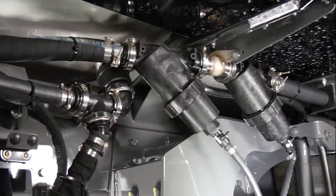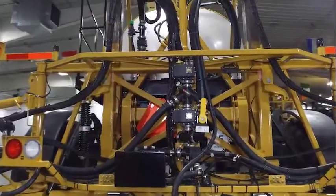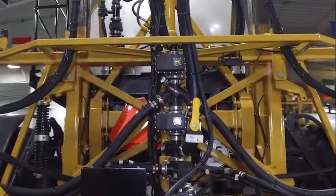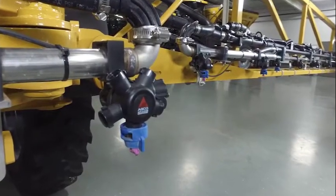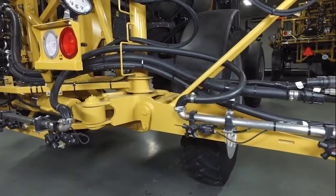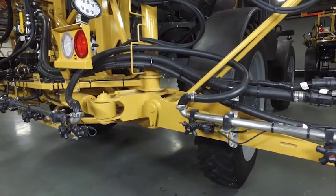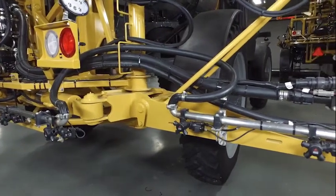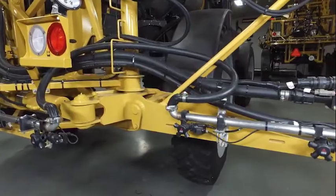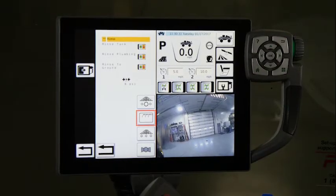Whenever product needs to remain in the sprayer, the operator runs into issues of product settling in the plumbing that can cause issues of plug strainers, flow meter, or nozzles. Also, they may have concerns of product impregnating the materials of the liquid system, increasing the chances of a cross-contamination when changing between chemicals. Reload and boom rinse to ground will solve those concerns.